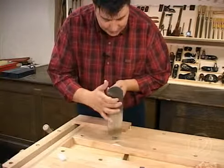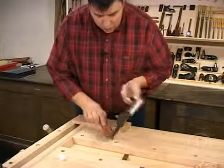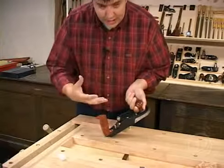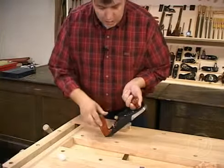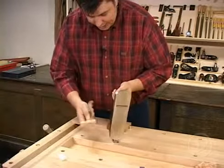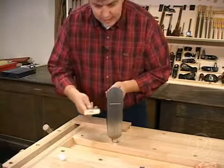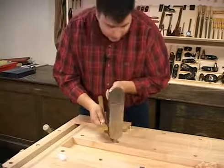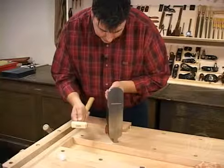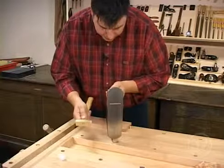In this case, the left-hand side is sticking out further, so you're going to want to move this adjuster to the left. Whatever side is highest, that's the side you move the adjuster to. I prefer to use a small plane adjusting hammer simply because it's easier to control the adjustment. So I'm just going to tap on the side of the adjuster here a little bit, and that's looking pretty good.